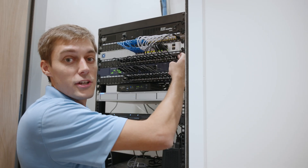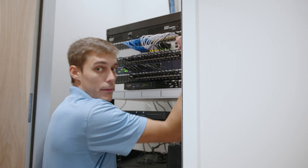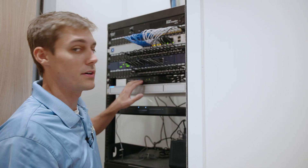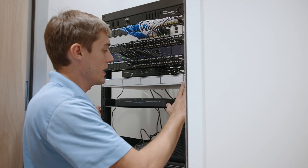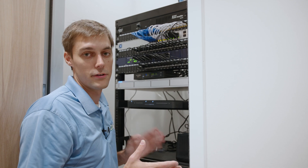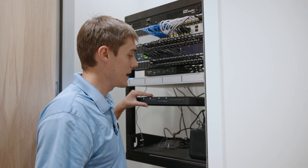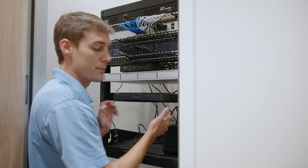On the Ubiquiti switch I also left port 24 available so I have my cable coming in, and then the cable around the back side goes down into our firewall. We typically get a rack mount for the firewall. The SonicWalls in particular have a pretty cool rack mount system that places keystones on the front side so you can still see the front interface and patch into it via keystone patch panels. Next we have our UNVR — we're currently using two drives in a RAID 1 of 4TB, which gives about 15 to 30 days of retention. Next we have our Comcast modem. I like to have this in a data flow: Comcast modem goes into the firewall, which then goes into your switches.